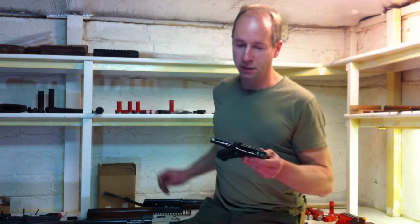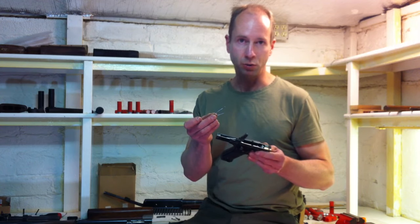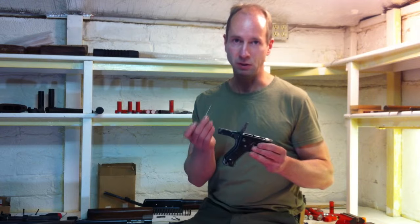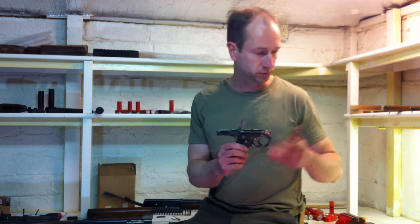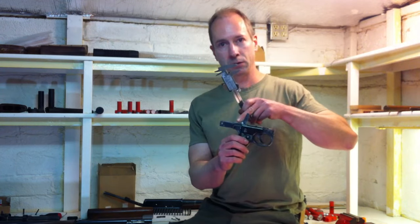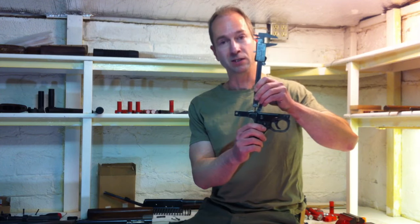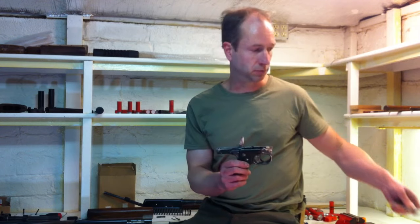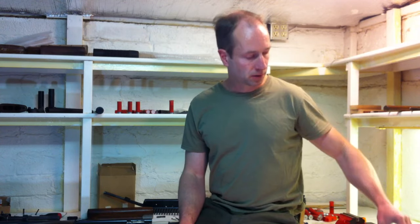spring in this area. This is a 2mm spring wire, cold bent, and the problem is that they set rapidly, so I always had to use a new spring, because this spring I used before the live fire demo, the tip of the spring was 15mm above that edge, and see where it is now after just 6 rounds. It's setting so rapidly it just requires a professionally made spring. So it will sooner or later develop light primer strikes again.